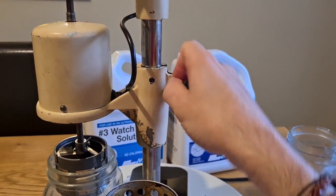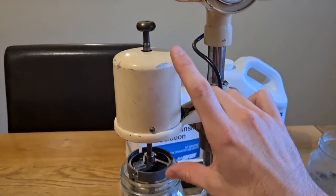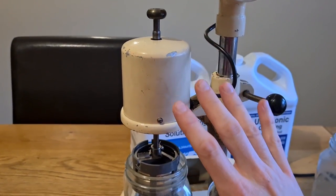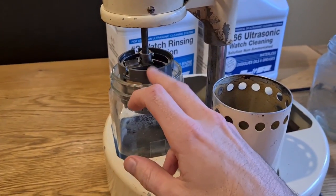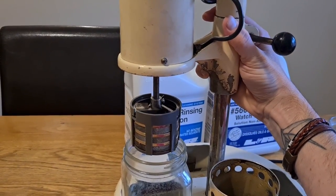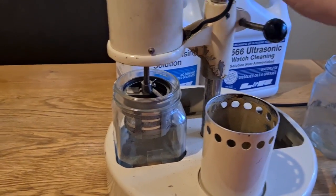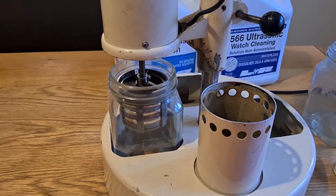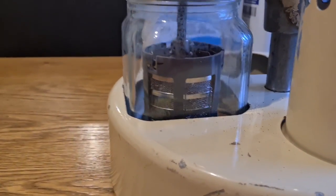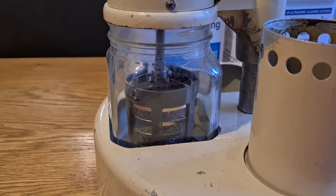We've got a nice Bakelite handle here for locking and unlocking the raising platform. I've rewired some wiring inside the motor. There's been a conversation about whether this handle should lift up and down - mine doesn't, and I'm happy with that. The way I've installed it allows me to rotate and change the basket with jars in place, but not with lids, so I have to take the lid off each job. I've marked the edge of the jars to the fill level so the fins at the top of the holder sit in the fluid and can agitate it when spinning.